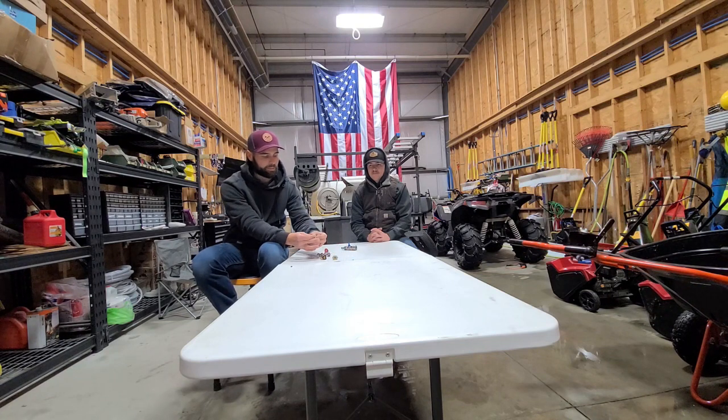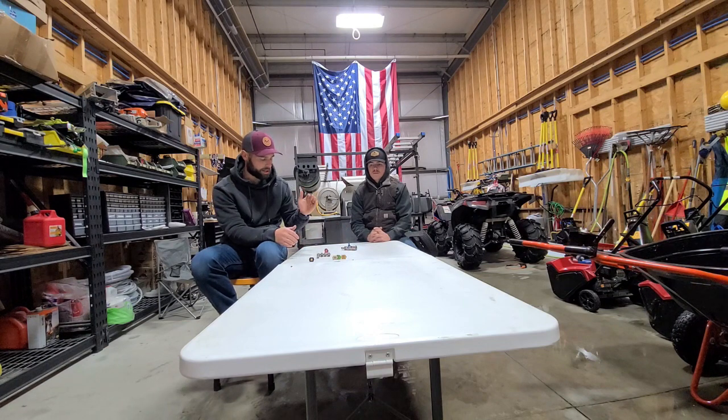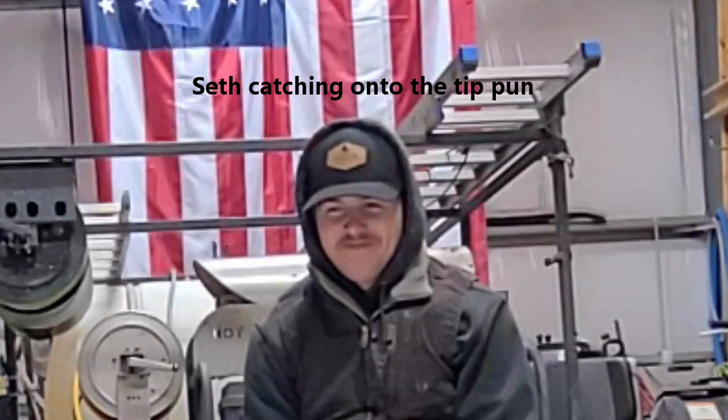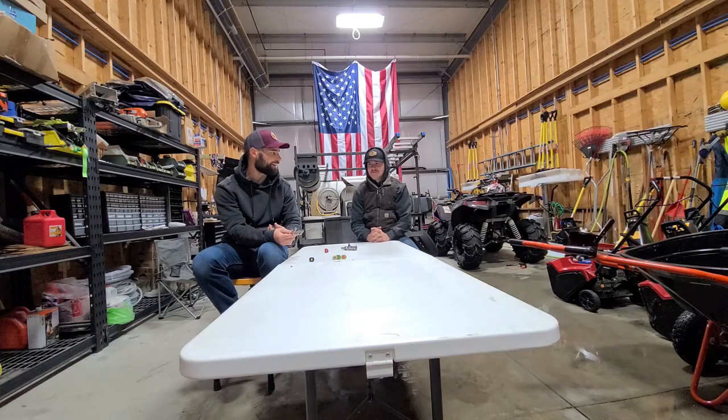If you only have these tips available, which you can buy some different tips that we would recommend, stay far back from the surface that you're cleaning. So you can kind of control the amount of pressure that's hitting the surface by how far away your wand or your tip is, or by the size of the tip that you have. So that's a little tip, and that's how we are able to wash with low pressure, how we're able to reach some of those higher areas without needing ladders, which is fantastic for us. We hate being on ladders. A lot of bad things can happen quick on a ladder, especially if you're using a pressure washer.